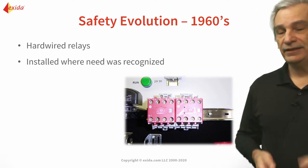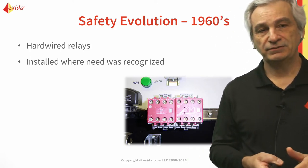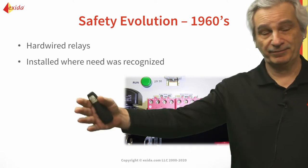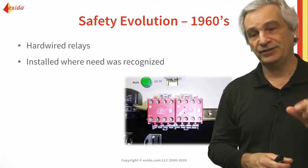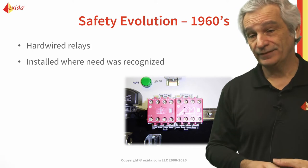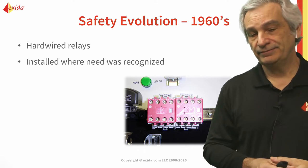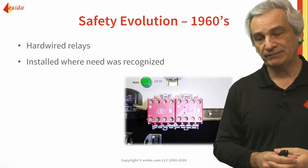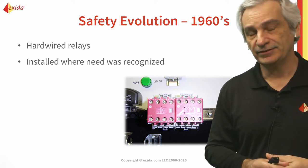Relays were pretty good, but the problems were: number one, they were bulky. On the output relays we had these big Potter and Brumfield relays that would take up massive amounts of room, and the motherboards to hold them had to be at least half an inch thick. They consumed a lot of power and energy, which made it difficult for a lot of applications — specifically offshore applications. In the 70s and 80s offshore exploration on the UK side and the Scandinavian side was very big.